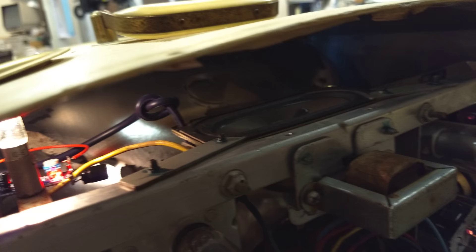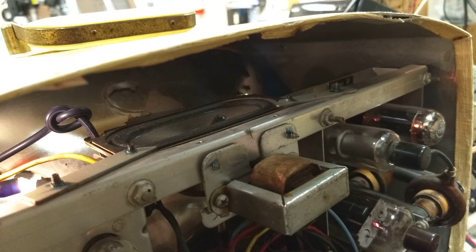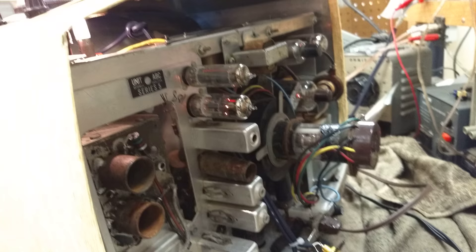The output transformer was relocated here — it used to be on the speaker. There's a little 2x3 speaker I mounted using brackets from an SL-1200 turntable — kind of crazy but it works. Behind the lamp there's the LM386 board; you can buy those for about five bucks on eBay. They're kind of handy.